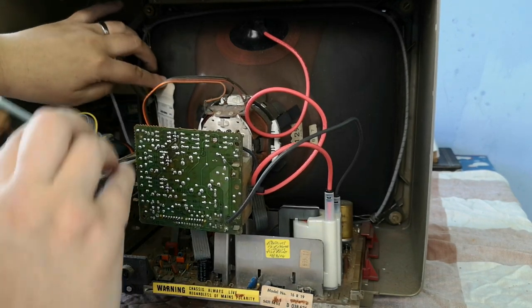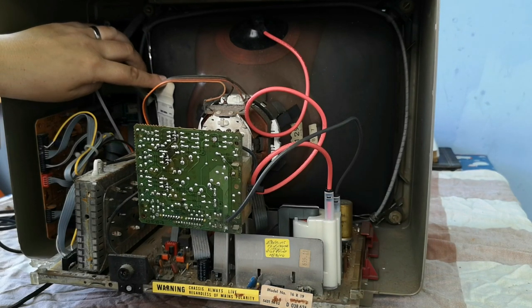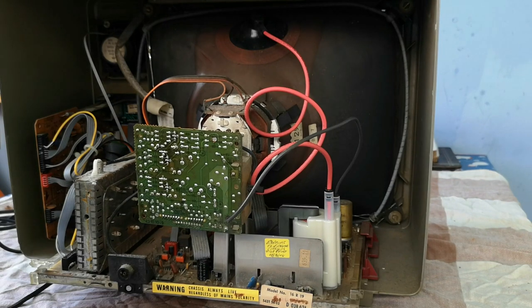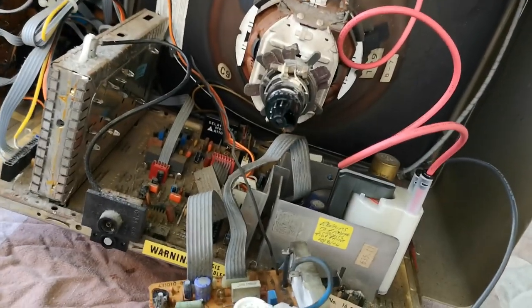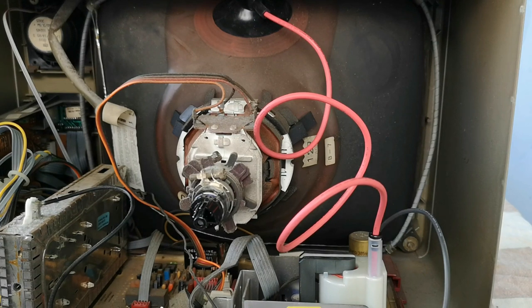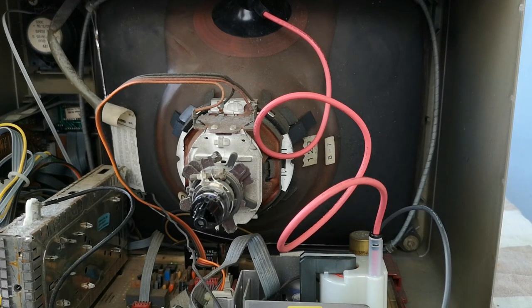This here is the tube type. The tube in this is a 420GJB22TC01, which from doing a bit of Googling and investigation is actually a Toshiba tube and has a number of patents specifically for this very small electron gun assembly. Look at it - it's tiny. There are three guns in there but it is really tiny. If you take the neck board off - look at that - for a color set that's a tiny little connector. I would guess we have red, green, and blue, and also one or probably a couple for the heaters, or they may be sharing a common earth, which is why it's probably got so few pins.